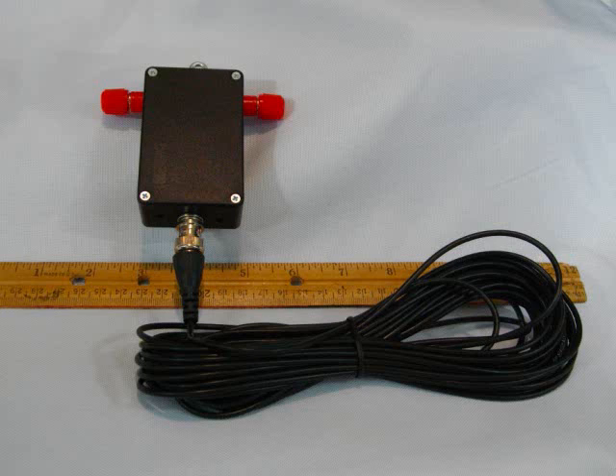At the present time I have not waterproofed this balun, because I'd like to have an opportunity to put the antenna up and check it with an SWR and antenna analyzer to see if it's alright. If it is, I'll seal this up with some silicone and it'll be ready to go.